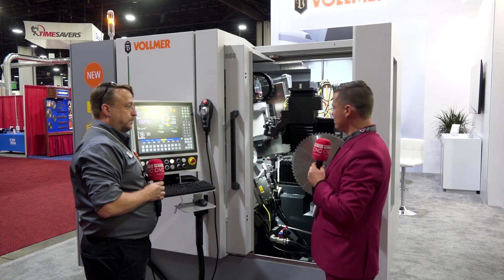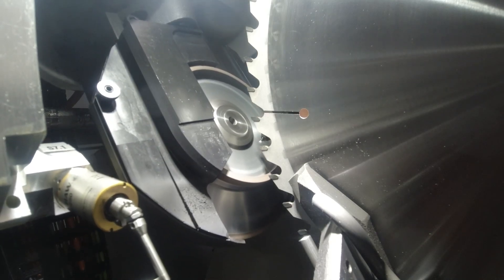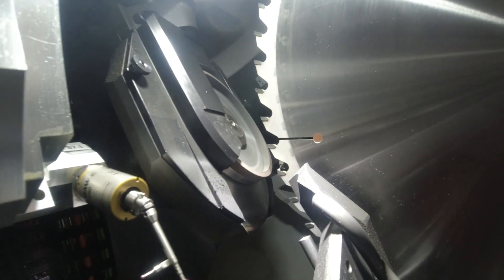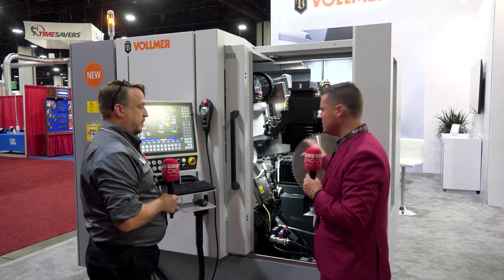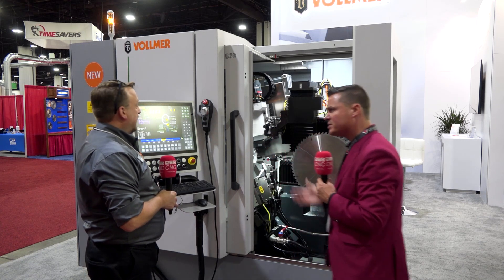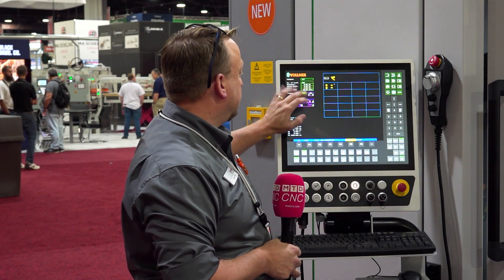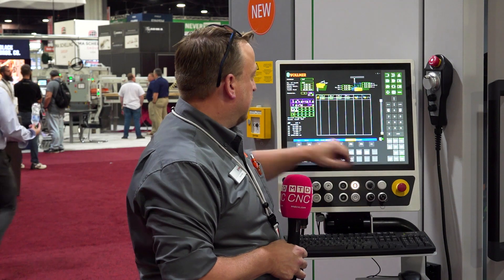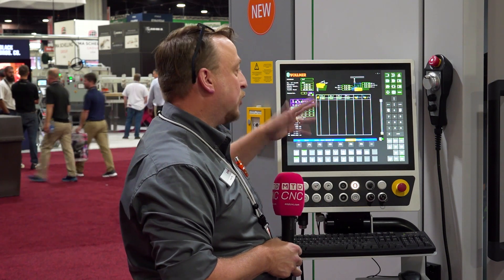So now we're talking about more rigidity, which allows us to make deeper cuts — oftentimes we're messing with carbide, so that's important. We're talking about a measuring system so we don't have to overthink and possibly make mistakes. We're talking about added precision, so we know that everything that comes off is going to be perfect. And even within this software, with that 24% gain, you have an added value where you can print out the measurements of the saw blade — for Z, X, Y, V, and W axes — including your diameters, back clearance angles, hook angles, kerf, tangential angles, and radial angles. That just proves at the end that it's within your specs.